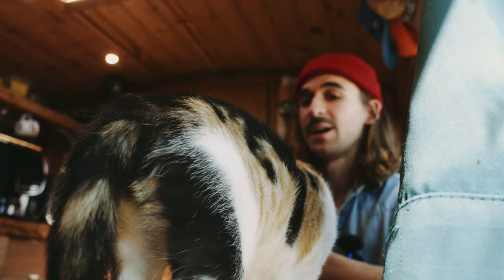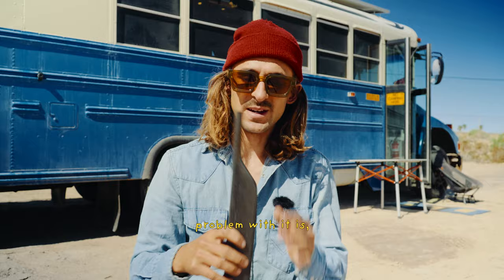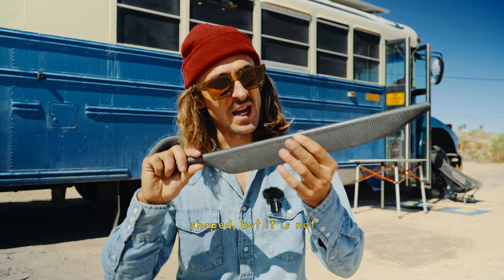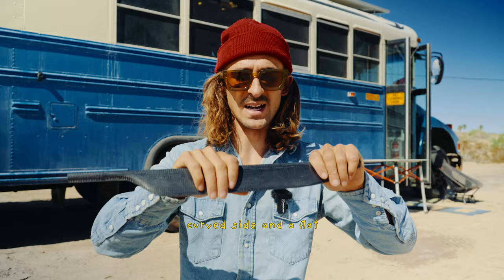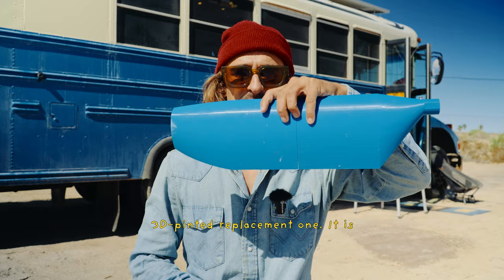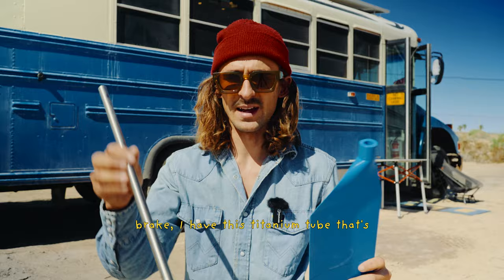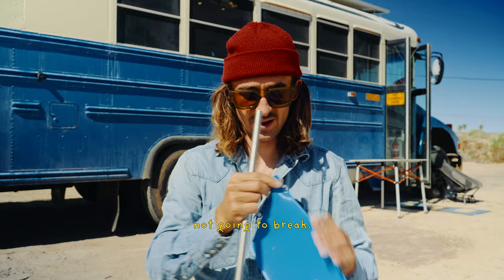This is the aerodynamic torque compensation fin that comes with my MagFly and is currently on it. My problem with it is most notably that this part right here is very, very thin. It is aerodynamically shaped, but it is not necessarily a true airfoil — it's a symmetrical shape, but there's not a curved side and a flat side; it's just a round member that tapers to a point. This is the 3D printed replacement one. It is slightly larger and it is a true cambered airfoil. And instead of this very thin carbon fiber that's susceptible to breaking, it uses a titanium tube that's not going to break.